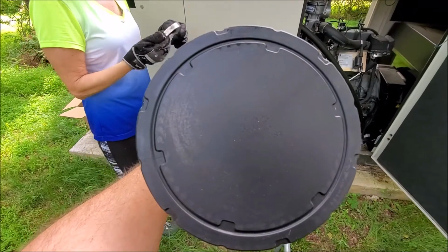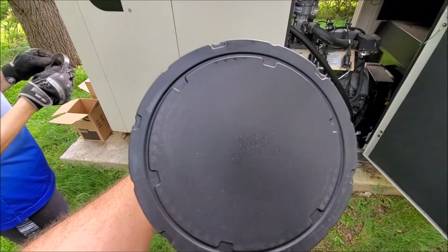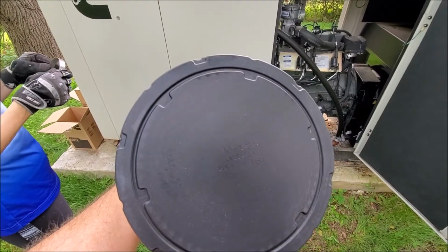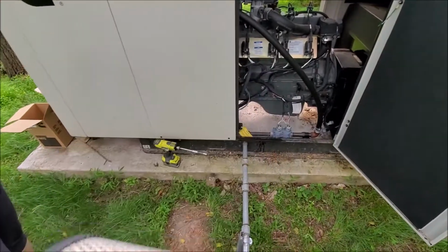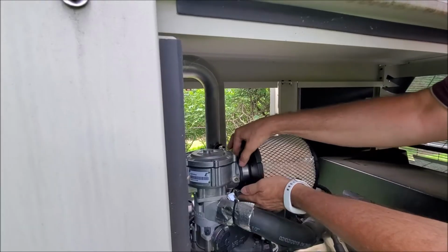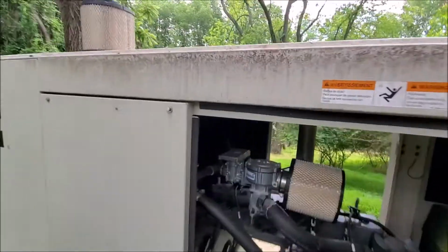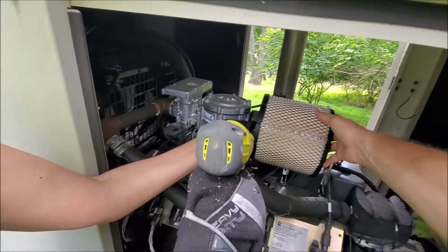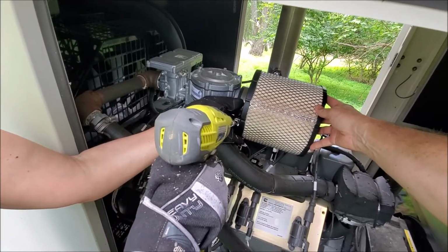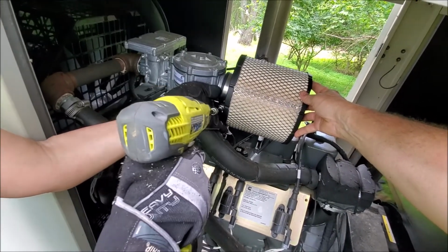Right, well hopefully you can see that, but it's an A042Y252 filter. You need to take the hose clamp and put it back on, make sure it's the right way around, so the screw faces you when you screw it back on. And then you grab your screwdriver, or in this case our little socket, that should probably do.